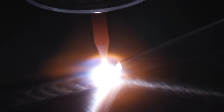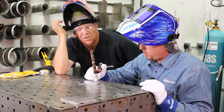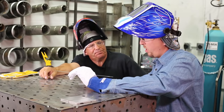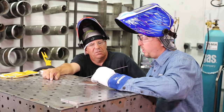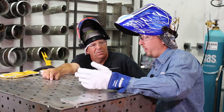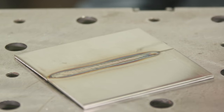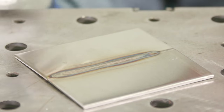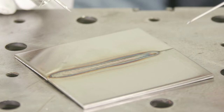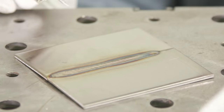You tend to decrease amperage as you come out of it? A little bit. When you get down to an end, the heat is going to build. In actual work, you'll start from an inside corner working your way out to an open corner — you've got less material and the heat is already built up in the material behind it, so you want to ease off, otherwise you'll blow it out. I like to put a tack where I'm going to terminate. Some guys will put an extra dab at the back and walk your arc up to wash the puddle back out. I tend to ease off and add one less dab right before the end — the last thing you want is to blow that out, terminate when it's really hot, and suck a hole in there.